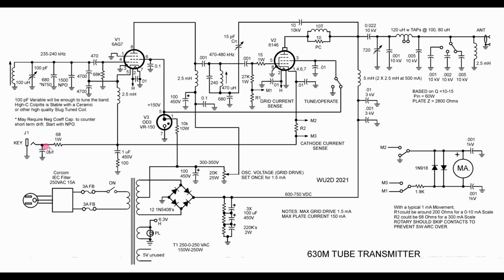There is a little bit of voltage on the key — not super high voltage, but enough that it will certainly get your attention if you contact this point to ground. High voltage — be careful. This thing can really knock you good and perhaps could be lethal. Be very careful when building a transmitter like this. Make sure you put shields over all the high voltage parts and the parts around the output tank. Throwing a front panel on it is not a bad idea — that's a good safety feature as well.